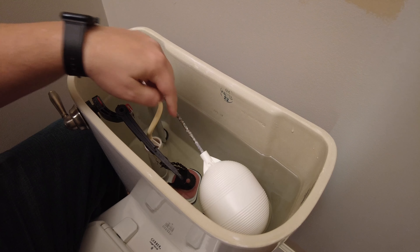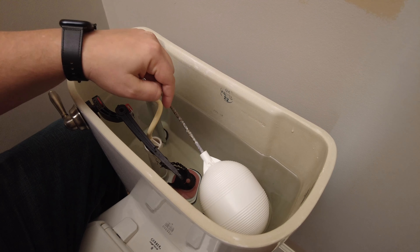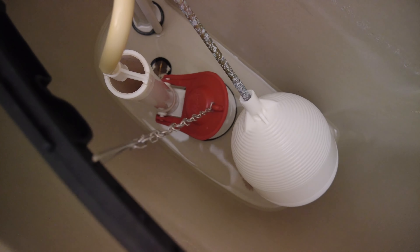The first thing that could be the issue is the flapper or the flapper seal at the bottom of the tank. It's a rubber valve that lifts to release water into the bowl when you flush. Over time the flapper can wear out, warp, or become misaligned inside of the tank, which will prevent it from having a tight seal. I've also seen them deteriorate if you use certain types of cleaning agents within the tank — especially cleaners based on bleach — which can eat away at that rubber gasket and cause the toilet to leak and continuously fill.